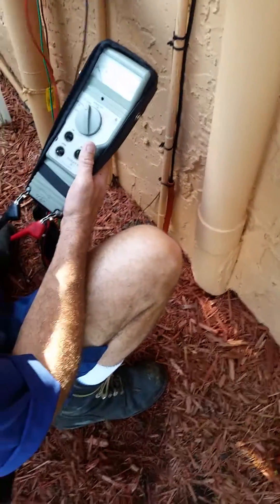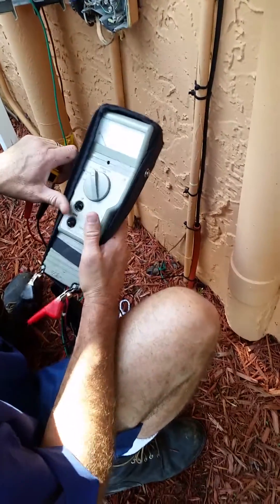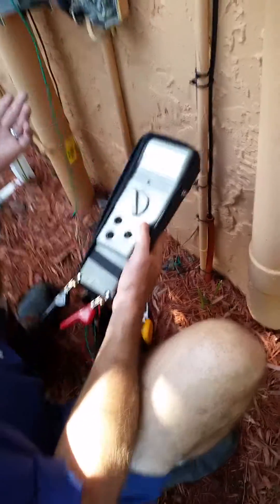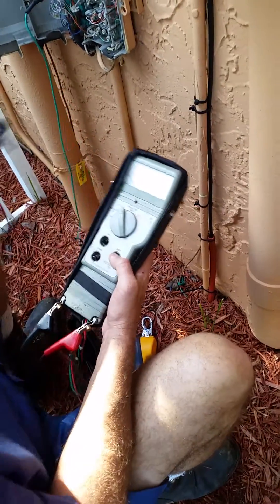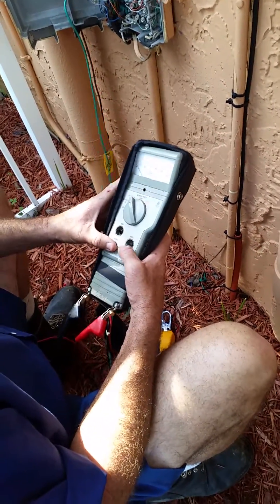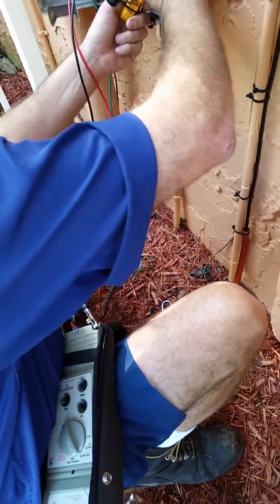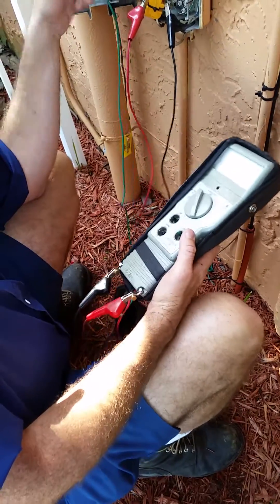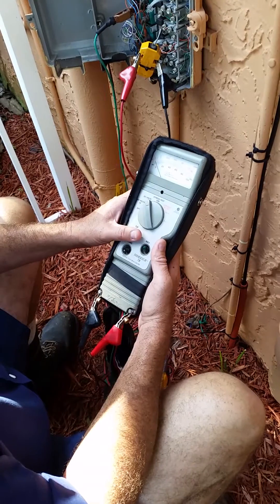This is the test case — like a lab experiment. I don't have it hooked up to anything. This one's looking for stray voltage. You can see the needle's not moving when it's not connected to anything. But when I hook it to line four — you'd expect nothing because it's totally disconnected — this is just the customer's wire, and I'm getting voltage on there.